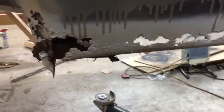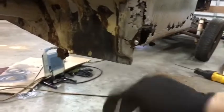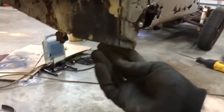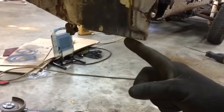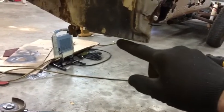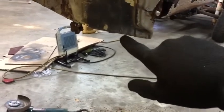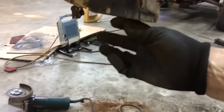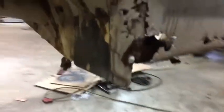The old channel is now out. What I've done here on the back especially — this piece here comes off the body and there's a line right here. From this particular piece to the bottom of the heater channel, it's probably about a quarter to five-sixteenths of an inch to the round of the bottom of the heater channel.